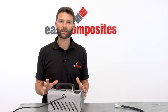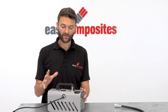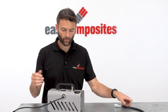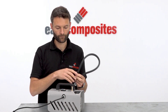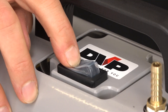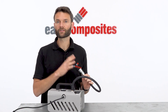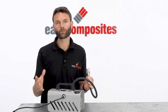Unlike many general purpose vacuum pumps, the EC4 is designed for continuous operation and as such can be run all day long without any risk to the pump or to the vacuum process, and the pump in operation is quiet and unobtrusive. It is important to note for continuous duty, however, that the pump must be running against a sealed bag or sealed equipment. See the user manual for more information on this.